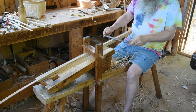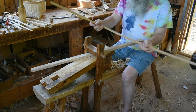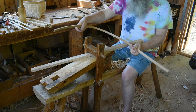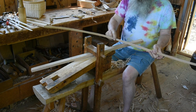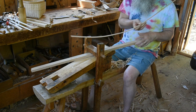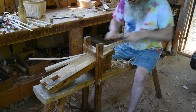The log's been under a tarp for a while as I've been waiting to work the rims and handles, so it's kept pretty green — split out of a larger billet yesterday. If your stock is drier than this, you can bend it by steaming it, and maybe I'll show you some of that setup later. Switching back to the drawknife — a little heavier shaving right there called for. More flexing, more testing of that bend. I've got a thick area right in here — from here to my left is heavy, about 20 inches or so. I've just got an extension stick under it to give it some support as I shave it.